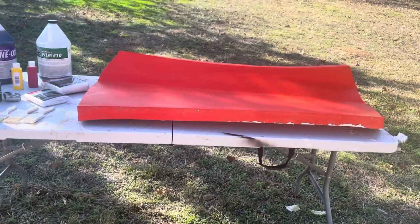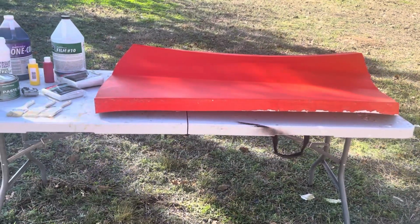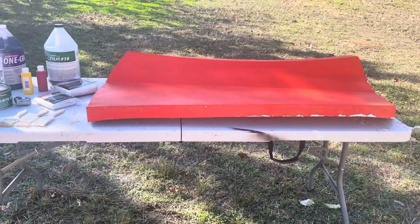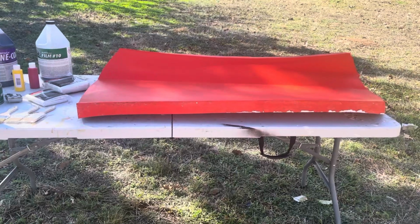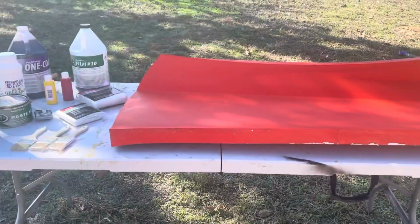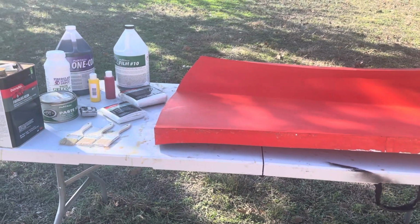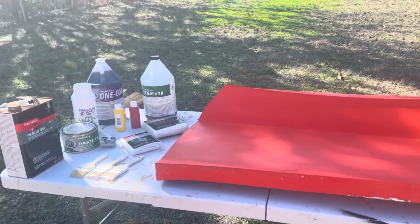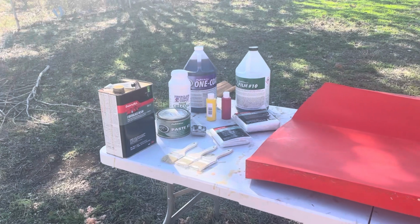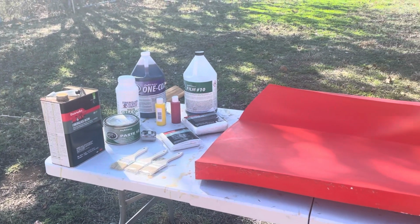Okay, the other thing I'm going to do is make that rocker panel. I've still got to go to Home Depot and get a piece of sheet metal, cut it to length 8 feet, bend it 90 degrees, and then do the same thing I'm doing here, except that fiberglass doesn't stick to that sheet metal, I found out. And it gives a really nice, smooth surface. So I don't need to mess with the PVA. I can put the gel coat on directly, put the fiberglass on it, and be done with it. So I'll be doing that later today.